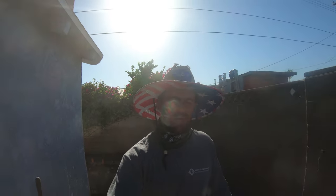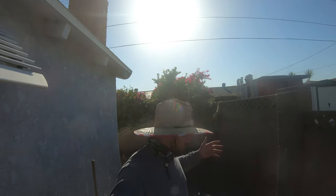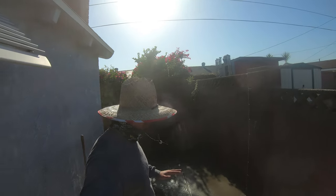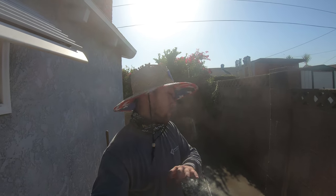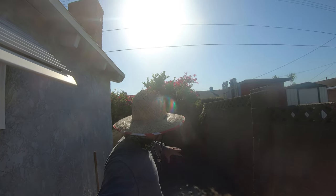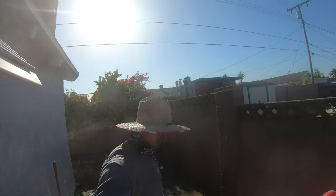It's the next day on the job. We just got back — the concrete turned out really nice. We just sprayed it down because it is really hot out — that's also why I have this around my neck, because my neck got a complete sunburn yesterday being out in the sun all day finishing the concrete. We wet it down because we don't want any spider cracking or any problems like that, so we got the whole concrete slab wet right now just to help it cure out a little better.